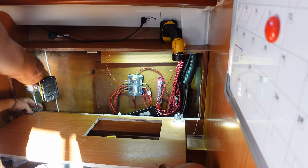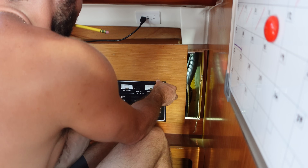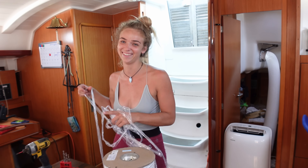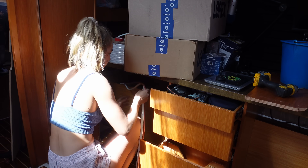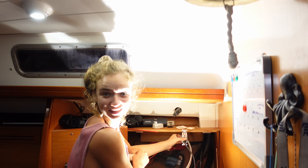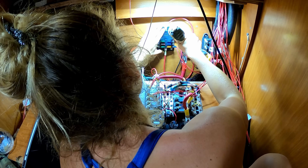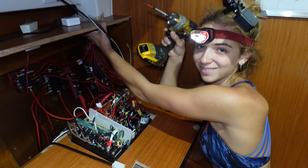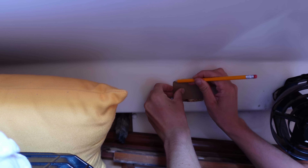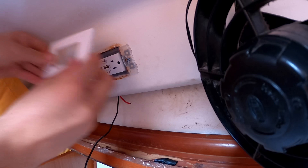Once we had our main power wires run to the back of the electrical compartment, we began planning and assembling the panel — figuring out which switch would power which items and what fuse sizes were needed. Since this panel was smaller than the last one, we decided to build a new cabinet door for it. We also hooked up our AC wire from our inverter to power the whole AC side of the panel. The boat used to be wired for 220 but since we switched to 110, we checked the existing 14 gauge wires and threw a 10 amp fuse on them. We also ran a couple extra outlets with 12 gauge wire and 15 amp fuses for higher-draw appliances.